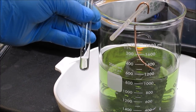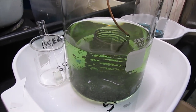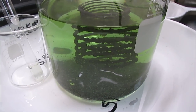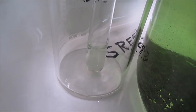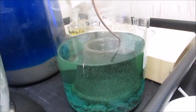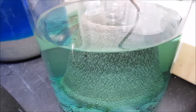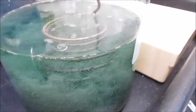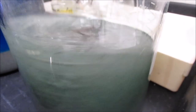DMG when it comes in contact with palladium forms a bright canary yellow precipitate. It might take a few minutes so we'll keep our eye on it. Our silver is coming out — you can see it falling to the bottom with a grey color. That's why it's called cement silver, because the silver powder looks like wet cement. The DMG test shows I can't tell a whole bunch of color change — so it's probably just a very slight trace amount of palladium.